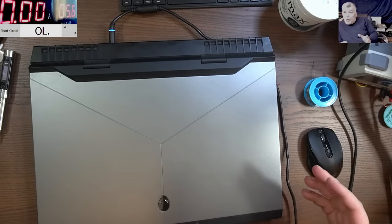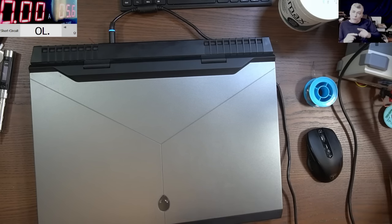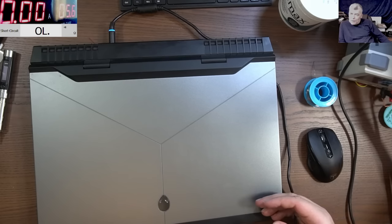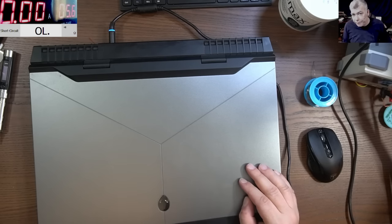I'm just trying to figure out how those batteries work. Even now I'm asking myself, when the battery shows locked, if I redo the fuse without resetting the battery, will it unlock automatically or not? That's a good question. Because the idea when I started the video was that if we charge the cells, because it was saying unlocked, we can repair this battery without the battery analyzer. And because we missed the fuse, I believe that's why the battery got locked.